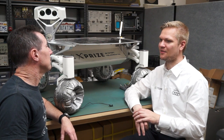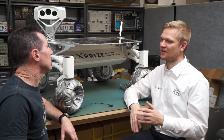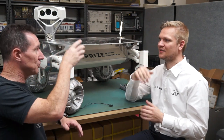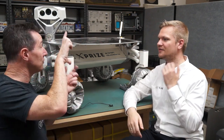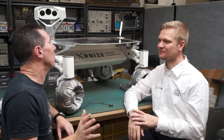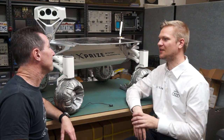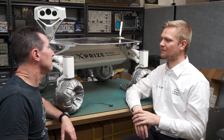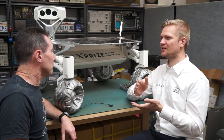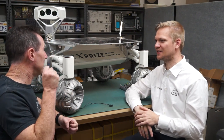Yeah, so those are really useful for detecting high transient spikes, because that's what SCR latchup will do. It basically shorts out your voltage rail, so you'll get a large spike that is not part of normal operation. The chip is really nice. It waits for, I think, 1 millisecond, and then it kills the power straight away. So that's pretty neat.